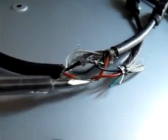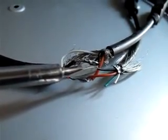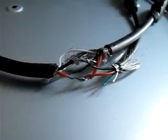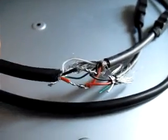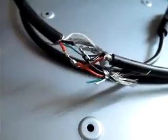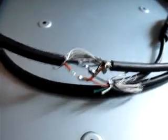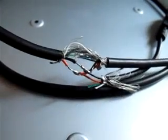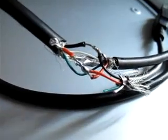Then on the main cable, you are going to de-insulate the positive and the negative — negative is black and positive is red. You are also going to do the same thing on the extra cable that you just crafted. Then you are just going to de-insulate the middle here and connect black onto the black and red onto the red. When you put them back together, make sure that you insulate the black and the red, otherwise you are going to have a short and you are probably going to damage your USB ports on your computer. So make sure that you insulate these two new connectors that you made — put maybe some copper tape around this and then insulate the entire cable.